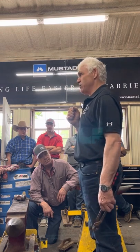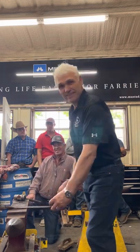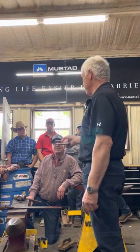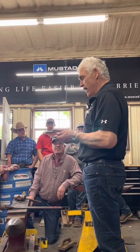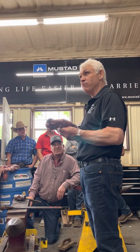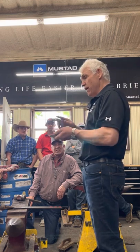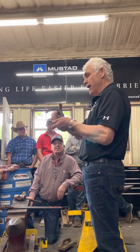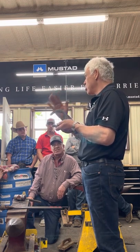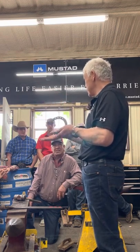Nobody said, what's the garniture? Or does everybody know? I was wondering how to say that. Yeah, you're too polite to ask. What's this edge called from the widest point to the heel? Boxing, yeah? Boxing. Well, garniture is the edge from the toe around to the quarters. It's that dividing line you have between the foot and the shoe, or the shoe and the foot. That edge right there is called garniture. That's the outside edge. Hemming is working the outside edge, making it narrower and straighter to compensate for how much the fuller is going to displace the material.